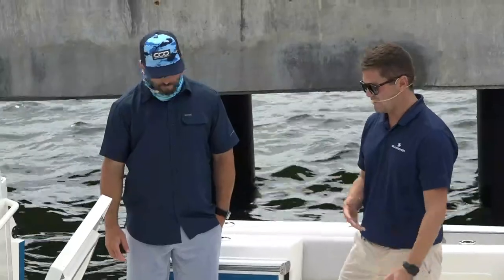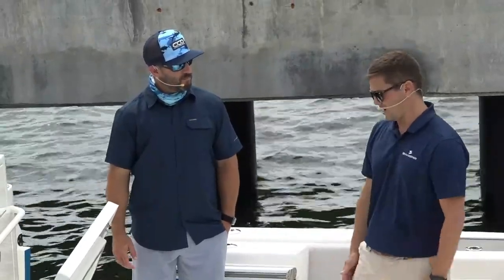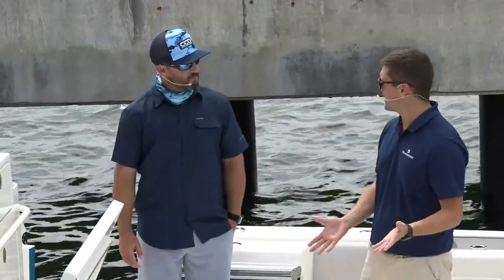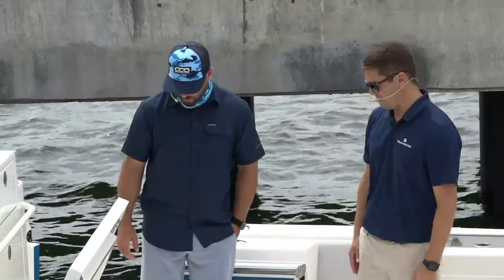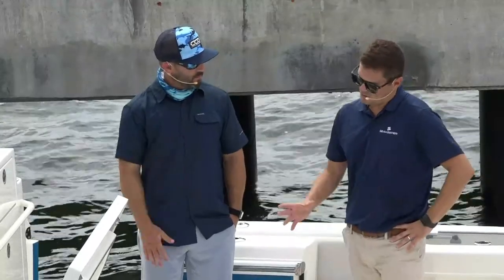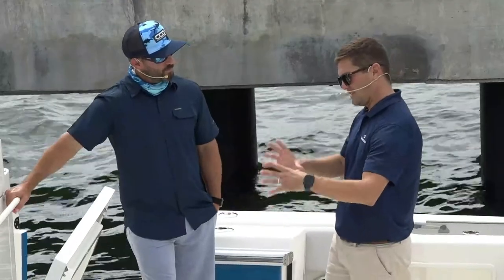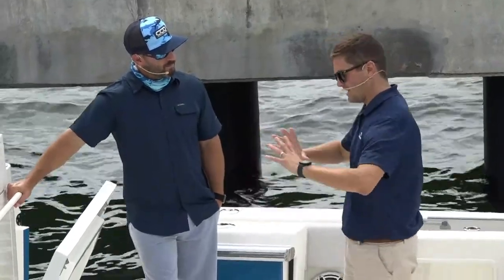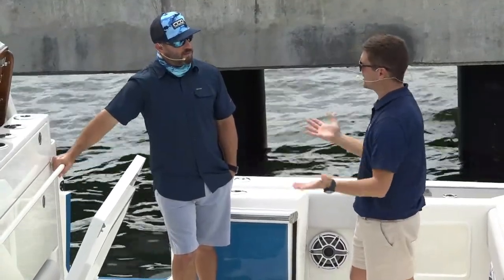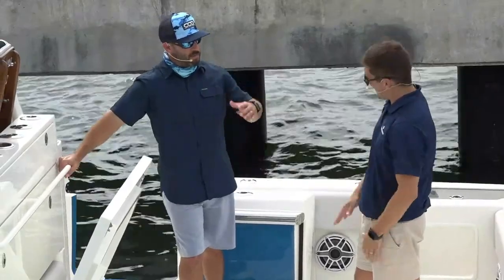And that max draw is about 2,300 watts on this particular model. But your operating range is anywhere from 1,000 to 2,000 watts, depending on sea state. Very interesting. So that thing spinning in circles at 9,700 RPM is what makes all the magic happen. So you've got the flywheel spinning, and as a wave roll comes in, the gyroscope itself, the sphere, is going to precess fore and aft. That's just naturally how a gyroscope works. If we learned about it in science, it's going to balance itself out, keep itself balanced.